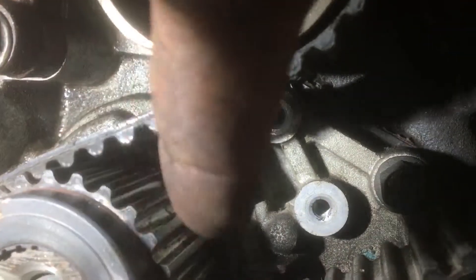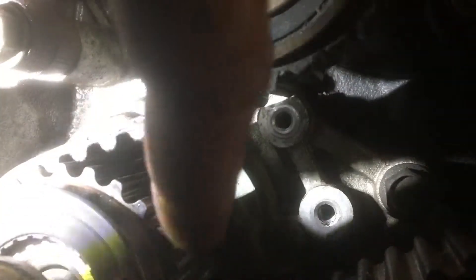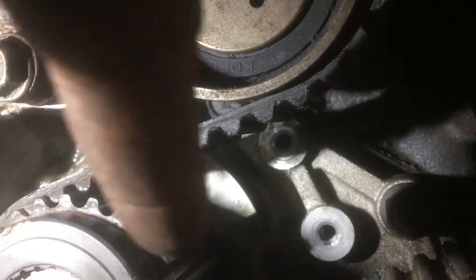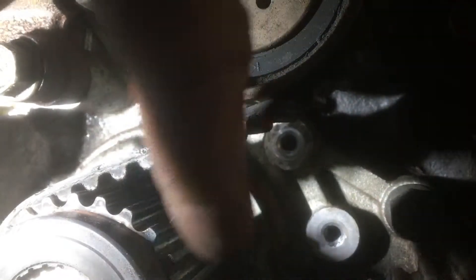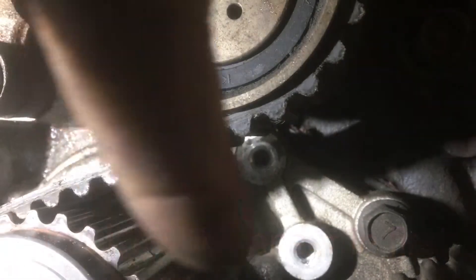Be very careful when you take this apart. I had this off because this was loose. When this plate falls off, there's two dowel pins that hold it in to the back of this. But there's a piece — a big washer with two holes in it also — that has to line up 100%. Make sure you get this all to line up.